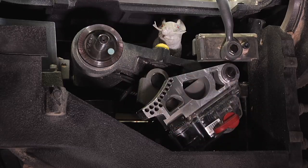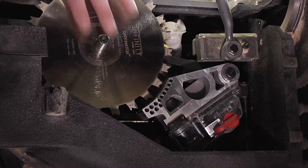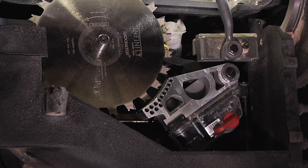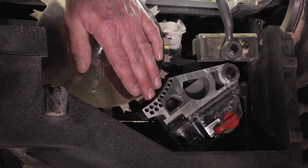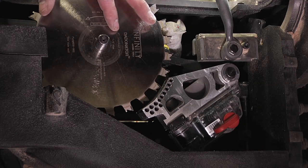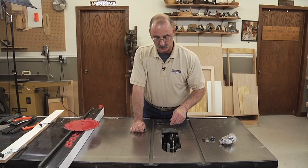And now, when I put my 8-inch blade on there, the distance from the blade to the brake is where we were at with the 10-inch blade and its appropriate brake. The other thing that's noteworthy is that the brake for the dado head is quite a bit wider, because typically dado heads are wider than conventional table saw blades.